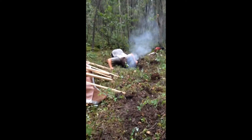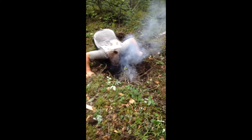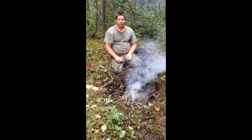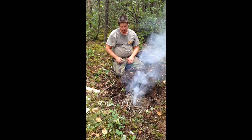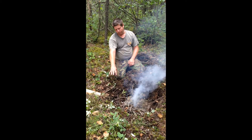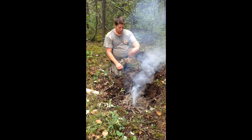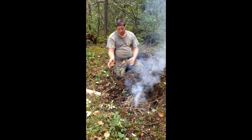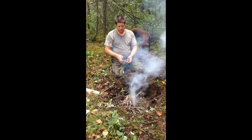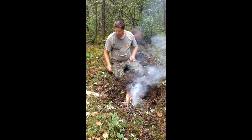I had a sneaking suspicion I wasn't going to be able to dig a hole very deep, and I was right. As soon as we got a hole opened up, we got down to some frozen ground, and that's when I started a fire to start thawing things out. We've got to dig down, then get a fire going — push the fire to one side, let the coals burn while I chip and dig the other side, then after a couple hours roll the coals over, chip and dig, chip and dig, and just keep doing this until I get down far enough for the outhouse.